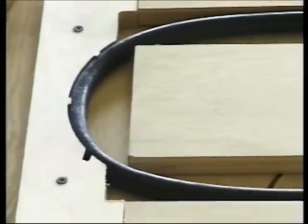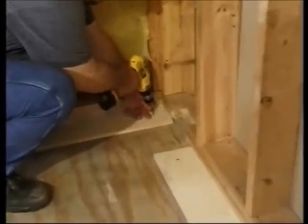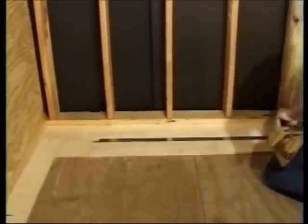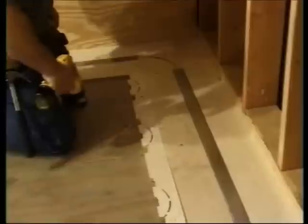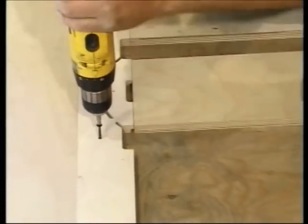When installing three-eighths inch Onyx, you don't need to secure the header plate because Onyx stays put without it. When your manifold is located above the floor, make a space in your perimeter band for the tube. Our goal is to run the tube to the far end of the room and then begin our layout. Lay down sleepers to form a two-inch radiant channel along the wall. On the other side of this sleeper, lay out a header stick and then locate another header stick on the opposite wall.